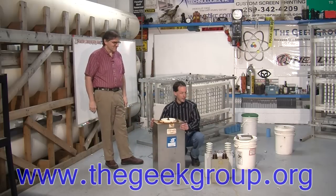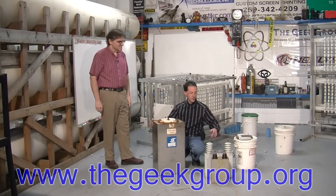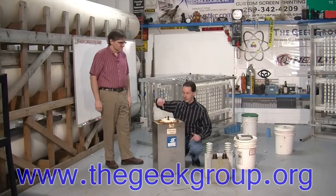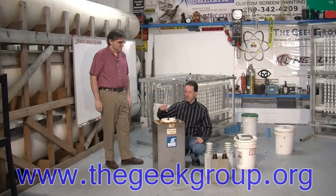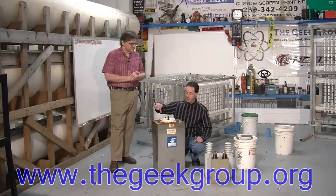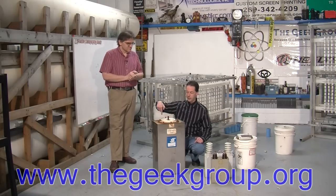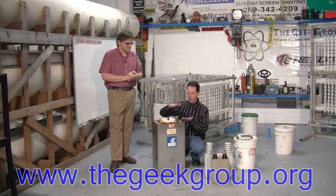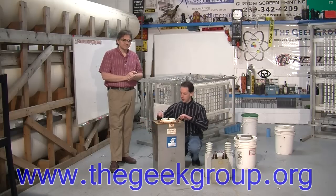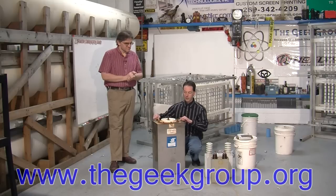Yes, they do. On these capacitors, let's say this is the positive, this is the negative. Usually it's hot and ground or whatever. On this capacitor, that big bolt in the middle is the hot electrode. That's the positive electrode of the capacitor. The dish around it is the insulator, and you'll notice it's really low. In fact, it's so short it's sunk into the capacitor. The entire shell of the capacitor is the ground. These bolts here in this ring are the ground electrode.